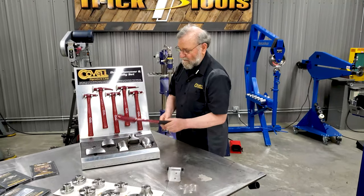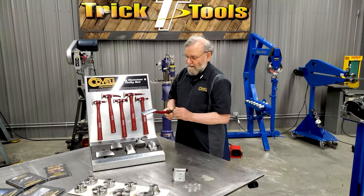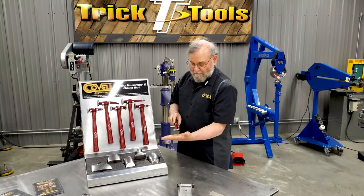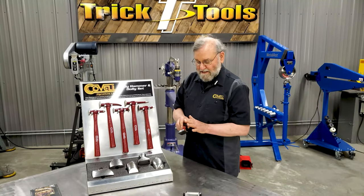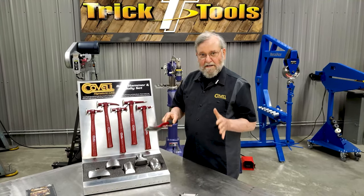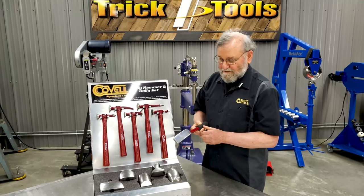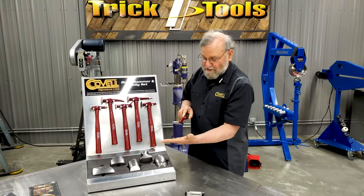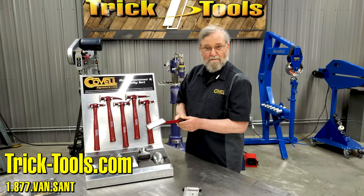There's also a slap hammer, and this is my favorite tool for smoothing lumpy metal. It has a very large low crown face, and you might think of this as walking with snowshoes. So what do snowshoes do? They spread your body weight over a large area so you don't sink into soft snow. This does a similar thing with metal. Because of the large low crown face, it spreads your hammering force over a large area and makes it easy to make lumpy metal smooth.